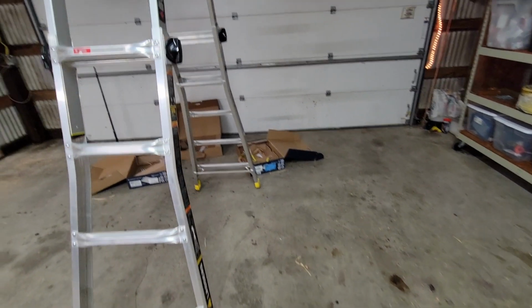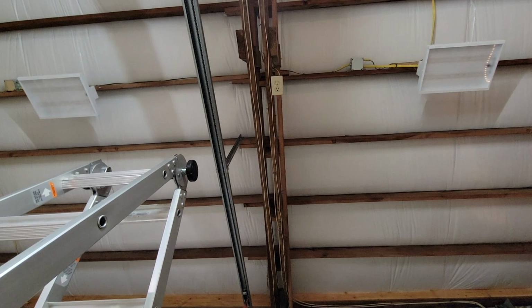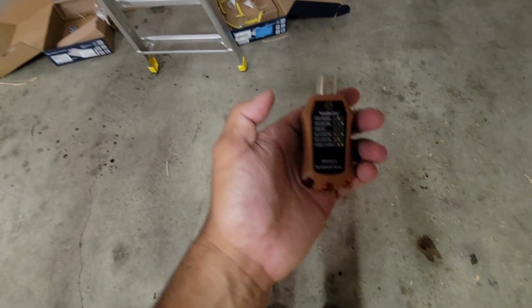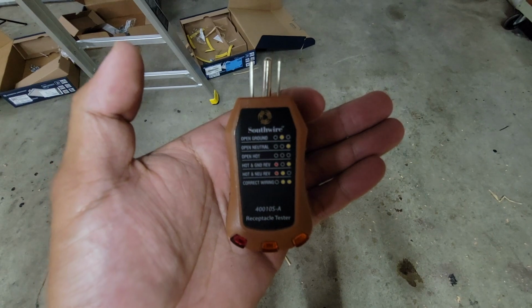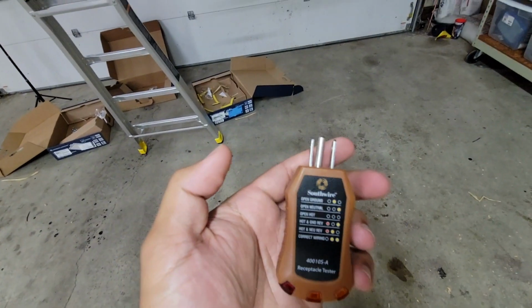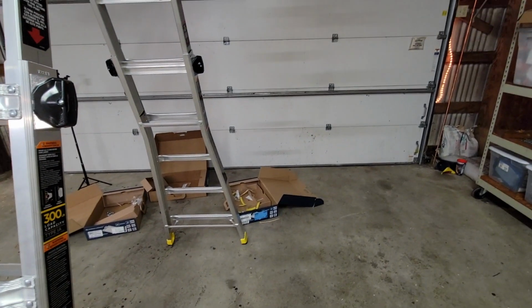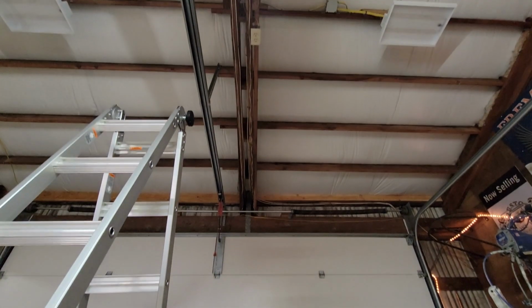First things first, we got to find out what circuit that receptacle is on so we can shut the power off at the panel. How we're going to do that is with one of these cheap receptacle testers, and you can pick them up at Home Depot or Lowe's. I'll put a link in the description of this one that I got. I think this was like $5, but let's go plug this in and then go look at our panel to see which circuit it is. So let's climb the ladder here and get her going.